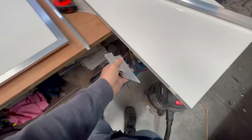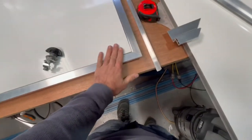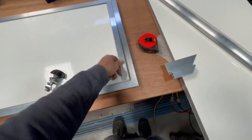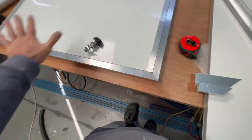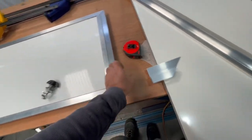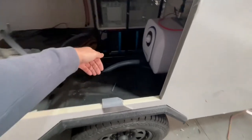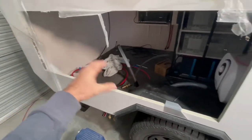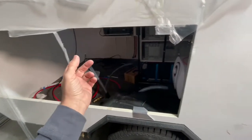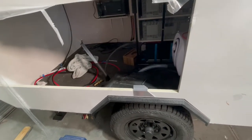The process is: these get glued onto the door all the way around with mitre cuts. Once it's glued on like these ones are, you get this bit of unequal angle trim that drops in there - they need to be mitre cut as well and run all the way around. That's the face you see on the outside. Then on the inside you get lengths that need to be cut and mitred into this profile. Those bits of unequal angle come in from behind and stick into the back. The point is, if it were a U-shaped piece you could only slide it on three sides - you couldn't get the last bit in because it would hit the sides already mounted. So the solution is you put that bit of angle in at the back to tie it in, making it strong, meaning you can put all four on without hindrance.